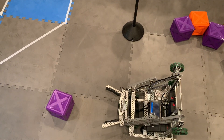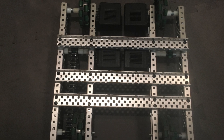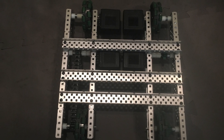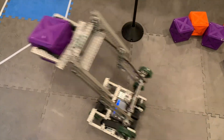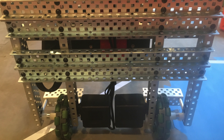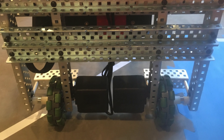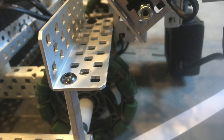Pippin was conceived as a simple bot that prioritized simplicity and maneuverability over high stacks and flare. For this reason, we built a cut-down chassis of 25x25 holes. This proved to be quite nice, as the bot is able to squeeze through tight spaces and avoid knocking over cubes. The cut-down length proved to perhaps have been a mistake, as the robot proved to be quite tippy when the lift was raised all the way. To further aid in the low profile of the bot, the wheels chosen were 3.25 inch omni wheels. Omni wheels aid in turning, and I wanted the bot to be as maneuverable as possible. The wheels peeking out the sides of the chassis was a feature we used in our turning point robots, and I still quite like it — they allow you to easily climb over obstacles, along with the potential for the wheels to still be touching the ground after a tip.